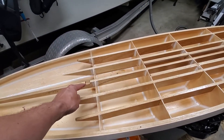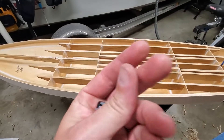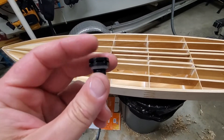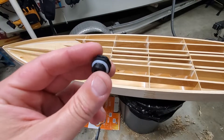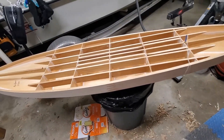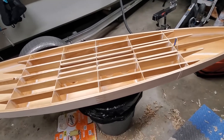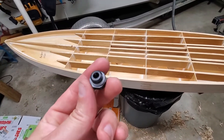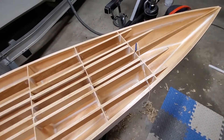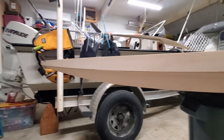For the vent, I've pocketed out a piece of the deck stringer there, which is well forward of where I'll ever stand. I'm just going to take the threaded part of the plug and thread it into the deck plywood - it'll have a nice smooth surface for the O-ring to sit on. I was also going to add a quarter-20 drain screw as a drain plug, but I'll add that later. I can also just use the vent to drain the board if needed - hopefully I won't have to, because that would mean it took on water.